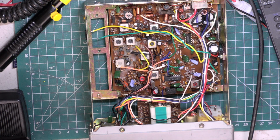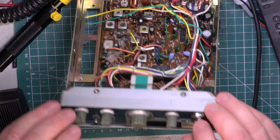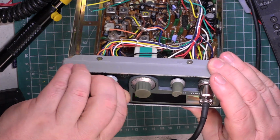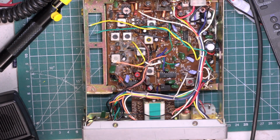Okay. So we'll go back to 30 microvolts, 10 microvolts, and it comes in at 100. And the whole thing should now be in kilter with itself. So we'll turn the signal generator to standby, we'll turn the squelch down, set threshold on the radio, signal generator on, and it's straight in.